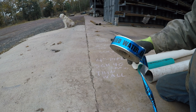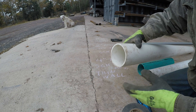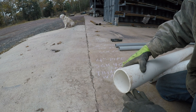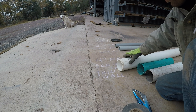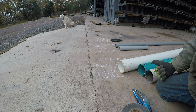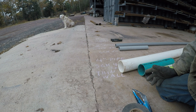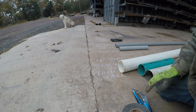I probably should do it for everything, because the Schedule 40 pipe is so strong you're not going to dig it up by accident — you're going to feel it with the bucket. Plus, whenever I'm on a site, I always ask the homeowner: where's the electric, where's the well line, where's the septic, any propane lines, any electric going to buildings?